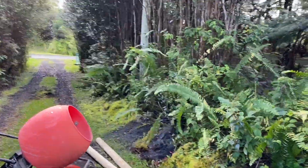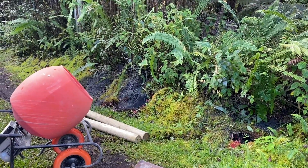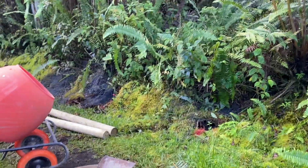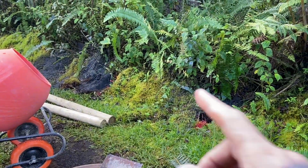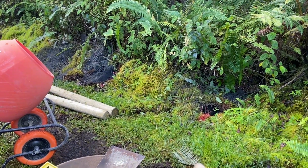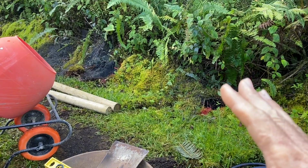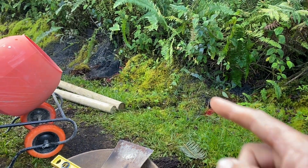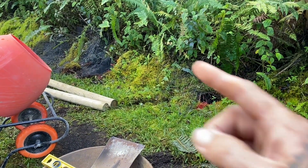So when you're doing fencing like this, which is going to be the hog fencing, or I guess any fencing, it's recommended that every 100 feet you put a wooden post or a set of wooden posts. So if it's on a straight line, you do 2 posts with a horizontal piece. If it's on a corner, it's going to be 3 posts and a 90-degree angle connected.